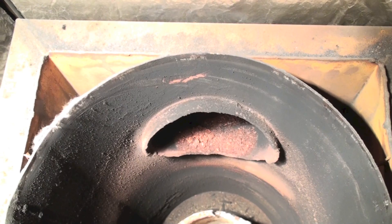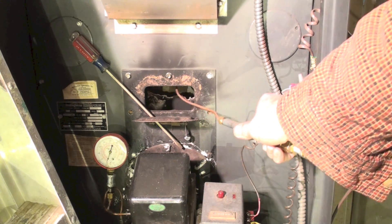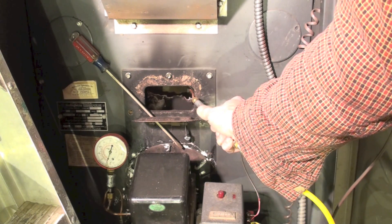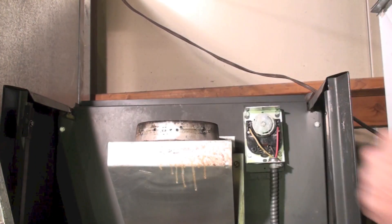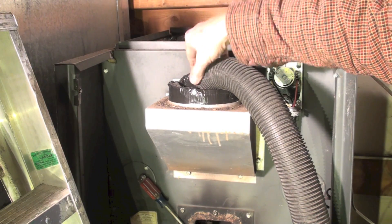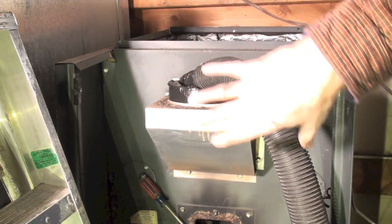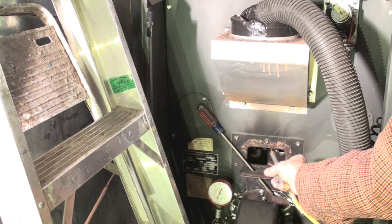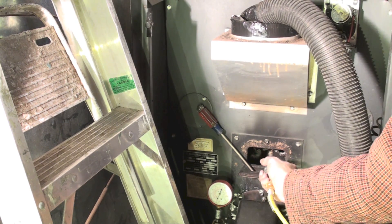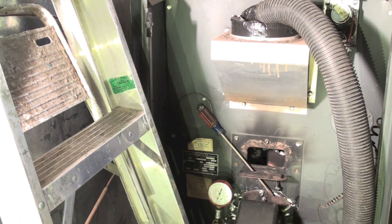The other half you do coming through the vent. Here we're showing the long air hose going way up in there and blowing in that direction. I'm doing that at the same time as I'm pulling off this collar. Here's a look at where the vacuum hose is on the vent collar — when I start it up it pulls through the heat exchanger and into that hole in the back. You can see I've got the vacuum cleaner running and I'm blowing the air up into that pipe — that should break the debris loose.